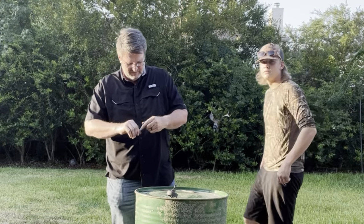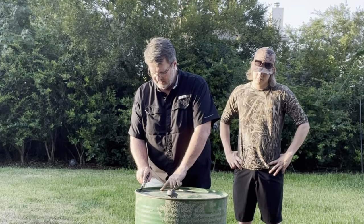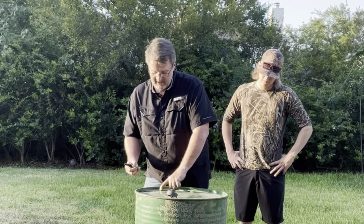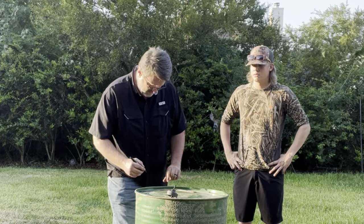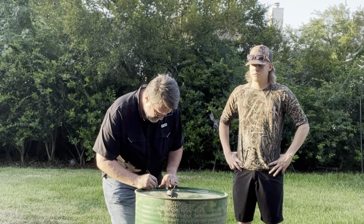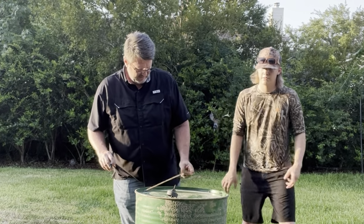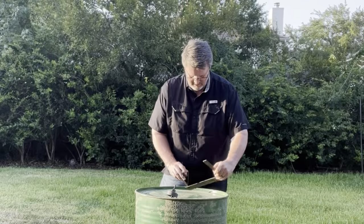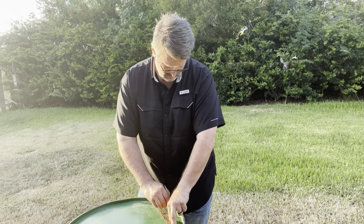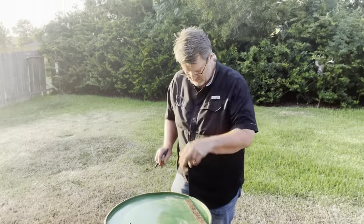What we saw on YouTube was to find any point and draw a line across here. I've got a short square, my long one is out at the property. This is 12 inches long, so I need to find the 6-inch mark, which is gonna be right there. Put a mark there. Then we're gonna come at almost 90 degrees here and do another mark just like we did before. We're also gonna mark that at the halfway point, which is 6 inches because it's 12 inches long.